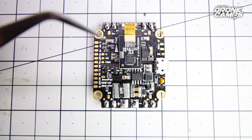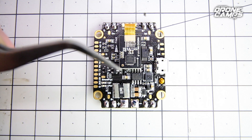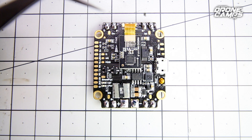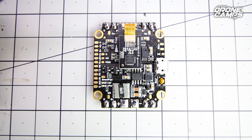As I've said before in flight controller tutorials, make sure you don't reverse any of your positive and negative wires — your red and black wires — because that will also cause an immediate short and fry this flight controller. Go back and carefully check over all of your solder points, double and triple check that nothing is in reverse.